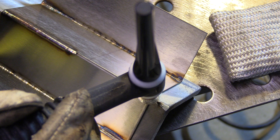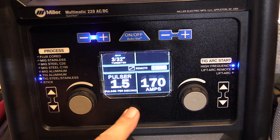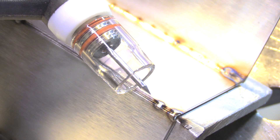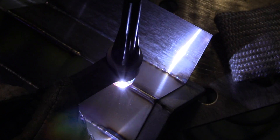The last thing I checked was the pulser function on a stainless steel outside corner joint, 16 gauge. I like one and a half pulses a second for little fusion joints like this — this comes in really handy for food service and kitchen stainless steel work. On this machine the other parameters like background current and pulse time on are fixed. I used 70 amps, and it appeared to be about 25 to 30% on the background current, which is about what I would have set it at. Although I'd prefer the ability to set background and pulse time on freely, this is a good all-around setting. Pulse is super useful for thin stainless steel like this for kitchen and food service work.